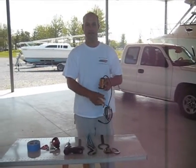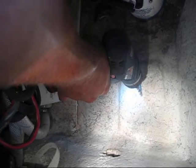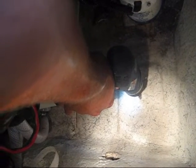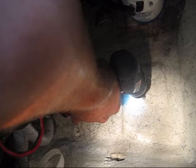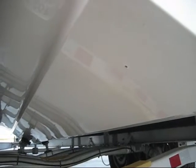In the next segment you'll see us preparing to drill the hole and marking the spot. Now we'll check out the bilge to find a good spot to drill the pilot hole. Here we are at the bottom of the boat and our pilot hole is in the perfect spot. Now we have our pilot hole, and the next thing is to use that hole as a guide to start our 2 and 3/8 inch hole to mount the transducer.